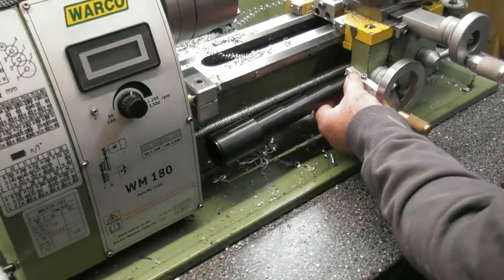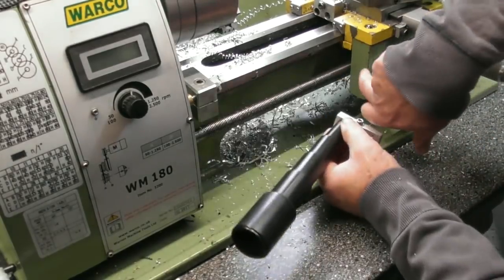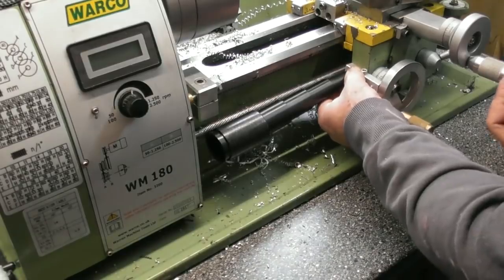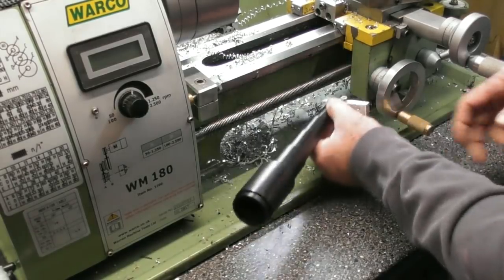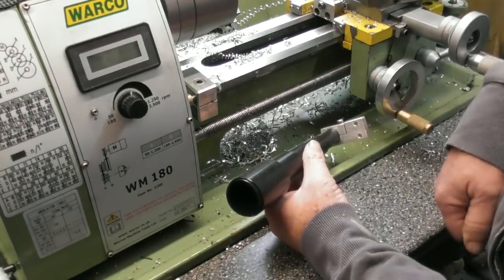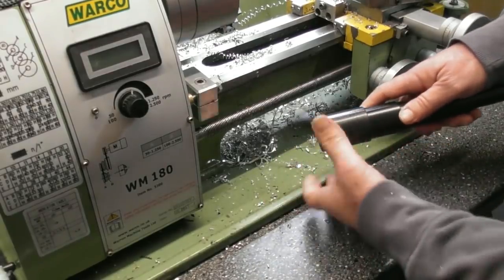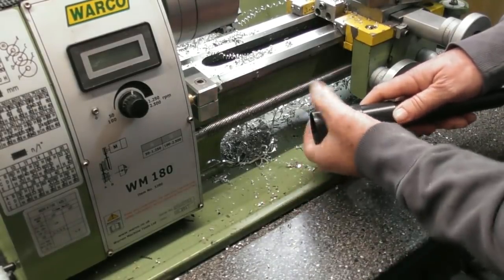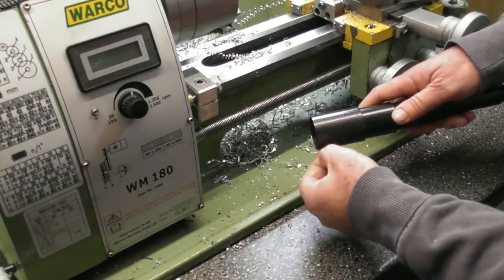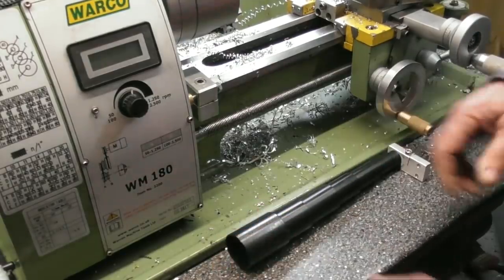As you can imagine, the bracket is going to go over the top of the lead screw and I've got two bolt holes to drill a couple of little M4 tapped holes in here to locate that end. My next step is going to be to make something very similar in the plastic from the chopping boards I bought earlier, to go on the other end. Obviously it'll have a 40mm hole to cover the 40mm tube. Similar again — couple of hacksaw cuts, bolt through it to clamp onto there, with a flange sticking out for me to bolt it onto the headstock end.